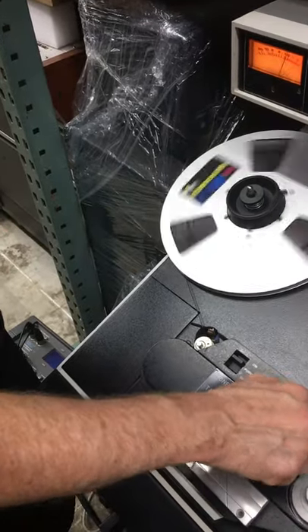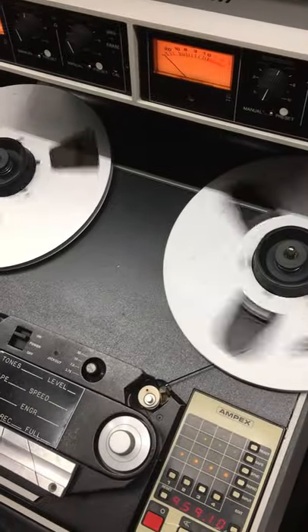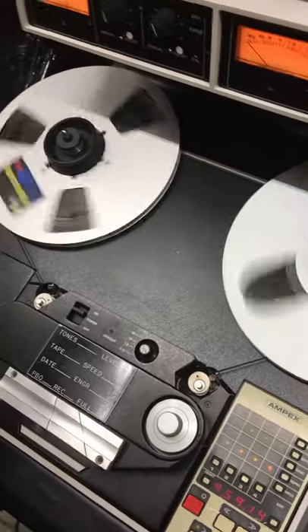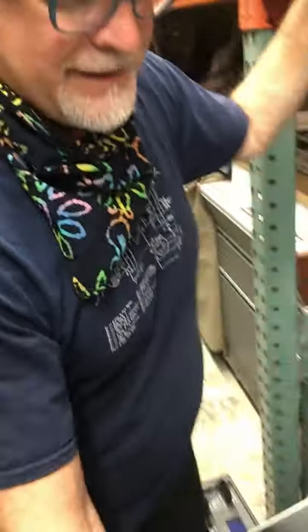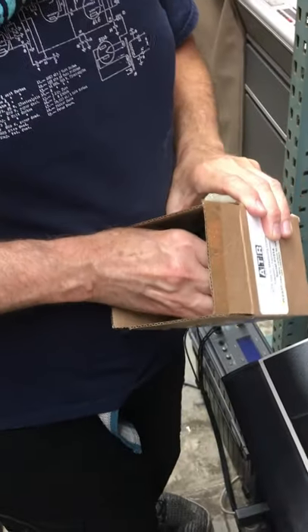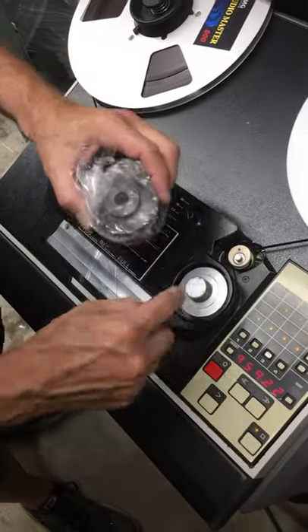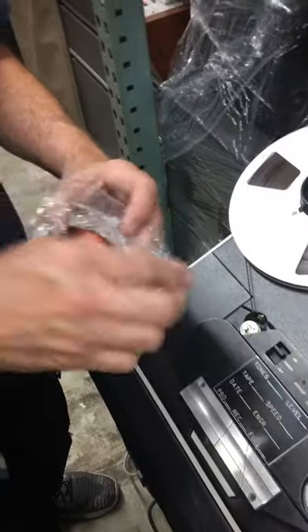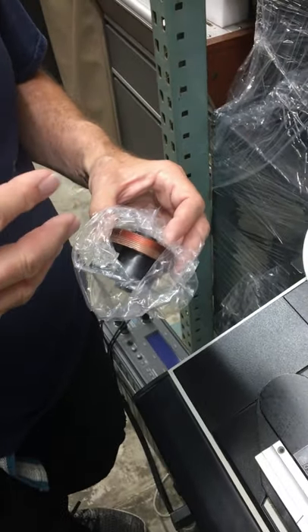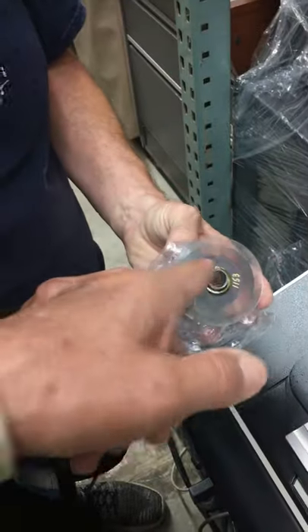Is that all an electric motor? There's no brain to this? Well, it's all chips — TTL chips. There's no computer. What originally I had to do was I replaced this roller right under here, under this cap. I don't want to touch it because it's all sticky. Why would it be sticky? The rubber — it's polyurethane, and it's decomposing. That's a reaction to oxygen — it turns into bubble gum.